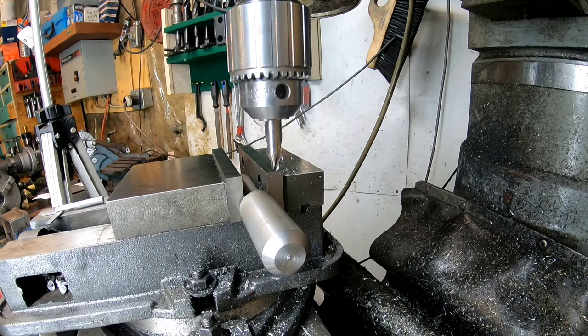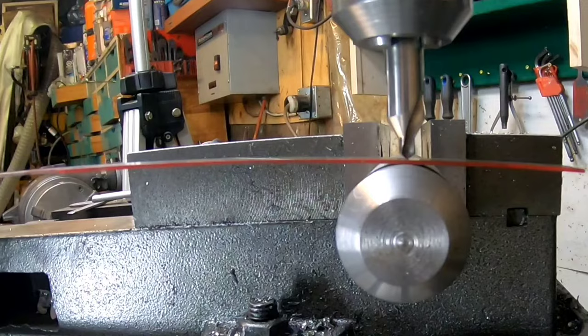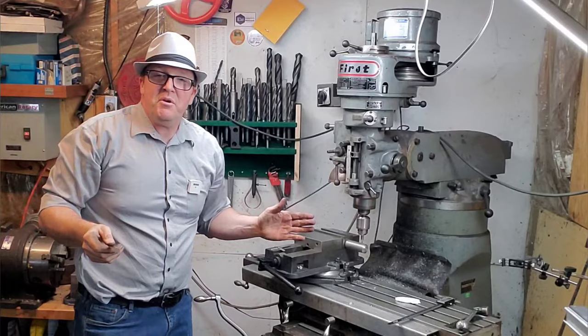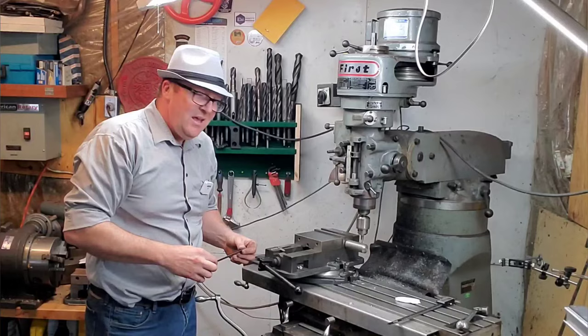Speaking of simple — the balancing ball ruler technique: by having a point and putting a bit of downward pressure and then bringing that ruler up to level, it's a pretty good technique. It actually got me a lot closer than I expected — on average within about five thou of finding center. I'm definitely going to keep this one in my toolbox.